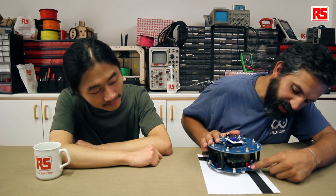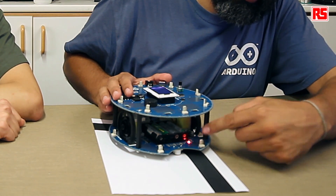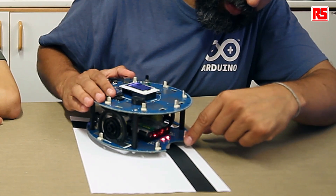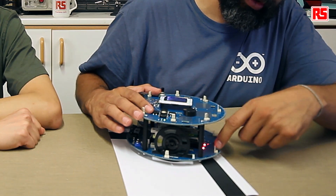This is a piece of a track. Let's turn on the robot and you will see how some LEDs go on — right now it's only one. This LED is going on indicating that the infrared sensor at the bottom of the board has a shadow on it. It's a shadow because the infrared light reflects differently on a black surface than on a white surface. As soon as the sensors reflect light on a black surface, the shadow makes the sensor get activated, and it's indicated visually here.